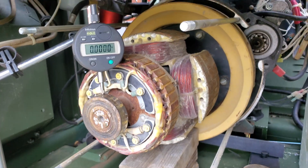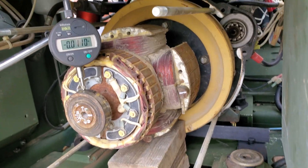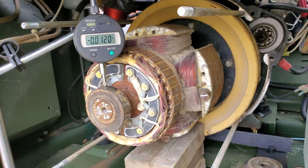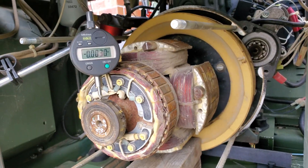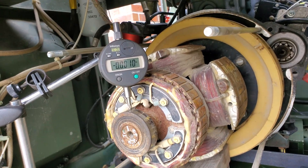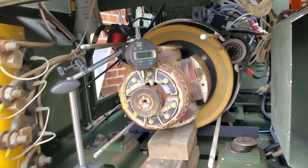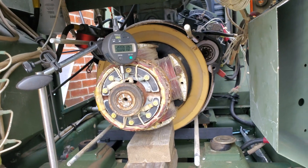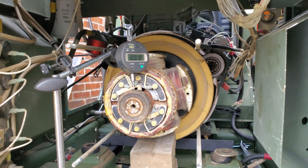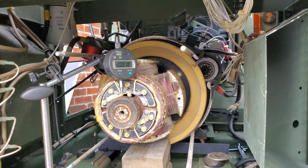You can see we're back to zero. Now we're going to go another 90 — and you can see it's down by eleven thousandths of an inch. We're going to rotate it one more time, and we're back to approximately zero. It looks like there's an issue with these mounting bolts up here that is actually holding the shaft a little off-center. With rotating machinery like this, you generally want to be under a thousandth of an inch, preferably under half a thou. Clearly, this thing has some runout issues, so we're going to take it apart and see if we can get that corrected.